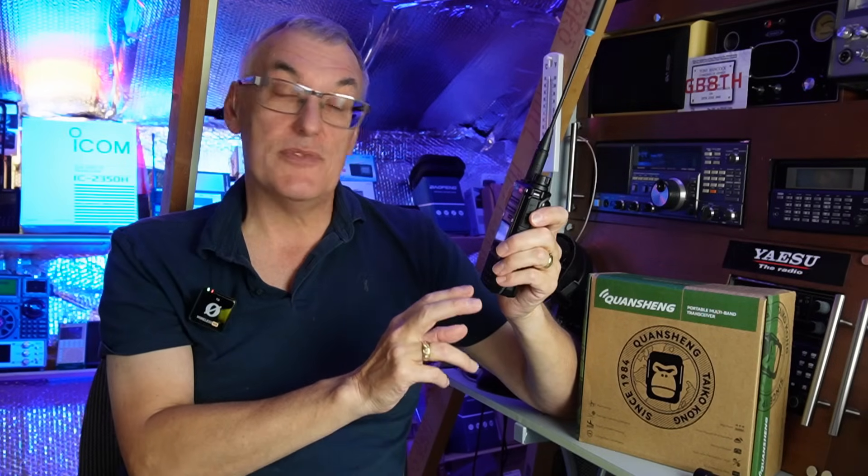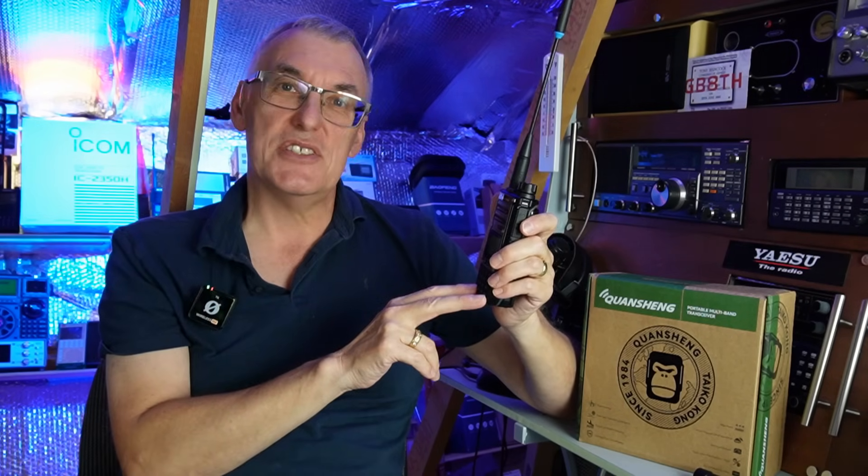Shortwave — it did receive some shortwave but I'll be honest, I struggled trying to get it tuned in. It really wasn't easy, so it's not the best shortwave receiver. FM was very good — definitely very good. And PMR, as far as both transmit and receive go, was also very good. And to be fair, on 27 MHz CB — if you look beyond the harmonics, which I have issues with — it certainly did a 2.5 km test no problem. So it works, it's just those harmonics.